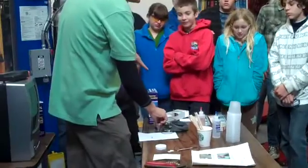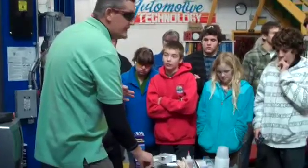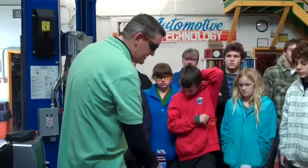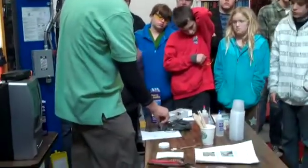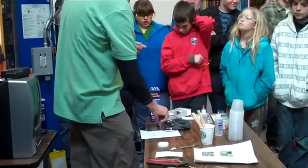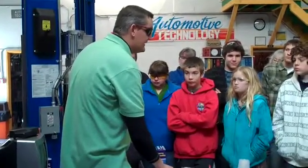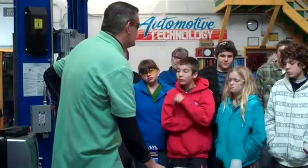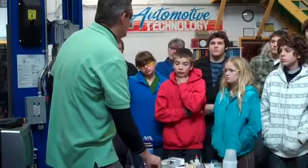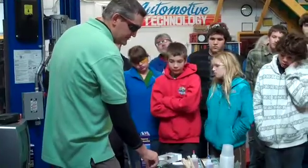It is in the instructions. I was going to say, other than your camera, your pigtail, and your power, there are going to be some instructions. When you plug your camera into a TV, there is a certain order you want to do it. First off, you plug the camera into the TV. So the RCA goes into the video in, which is usually the yellow. That goes into your TV first. Then you hook your camera power up and plug that in. And the last thing you're going to do is turn on your TV. If you don't do that, it usually is okay, but sometimes that can break your camera if you don't do it in the proper order. So just remember there's a simple order, and that's what you want to do.